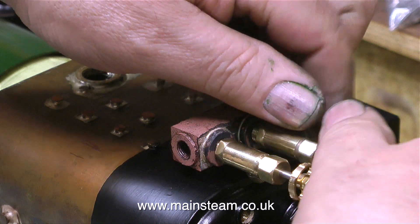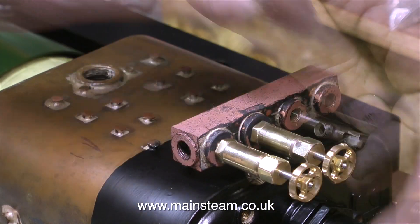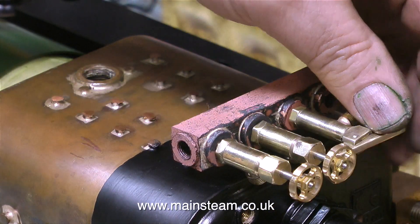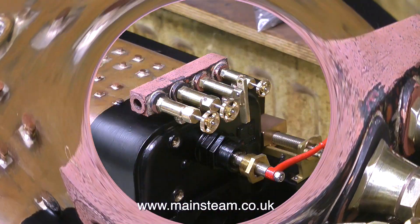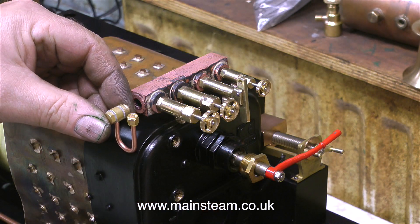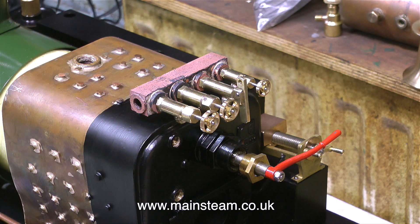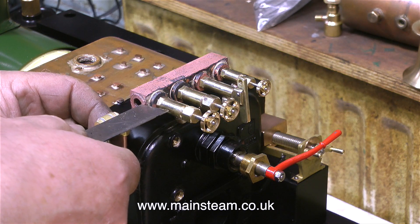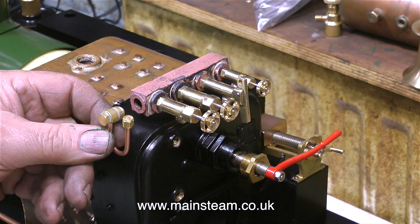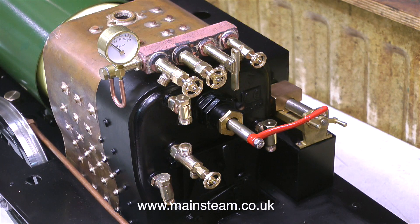I'm temporarily fitting this to the locomotive to see what it looks like and to make sure it fits, and it seems to be okay. That's the second injector valve, this is the whistle going in place, and finally the blower valve. Now that the turret is fitted in place on top of the firebox, I need to find the best method of fixing the pressure gauge to the turret. By holding the pressure gauge siphon in position, I take a measurement — which is 3 quarters of an inch from the end of the turret. All I need to do is machine up an extension piece from a piece of brass hexagon, and here it is fitted to the turret — I can definitely live with that.